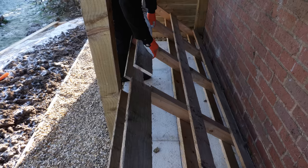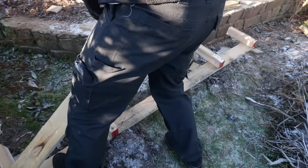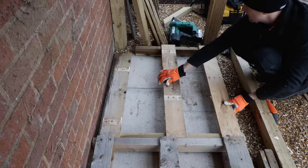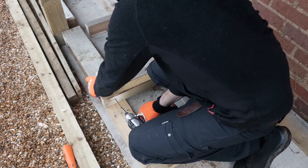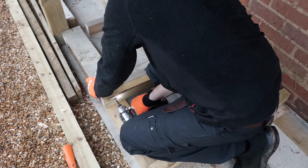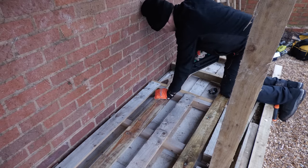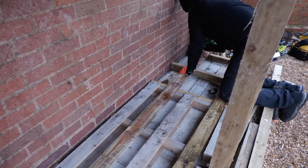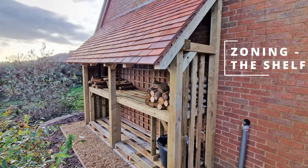Frustrated by this I went back to my old brushed saw and trimmed the edges using my rafter square as a guide. Circular saws are brilliant for jobs like this, and that Ryobi HP still had a part to play — more on that in a bit. I then cut by hand a section off the pallet so that it would fit neatly on the paving slabs. I broke up the offcut to salvage what I could and extended the length of the pallet to the full width of the log store using some 3x2 leftover from my plasterboard fixings video. I introduced new slats on the pallet as the existing ones were a bit far apart, using 100mm gravel boards bought from a local timber merchant. The Hikoki framing nailer was something I bought for the garage roofing project — hammer and galvanized nails would have done the job fine. And that was the pallet base more or less done.